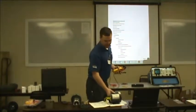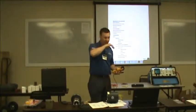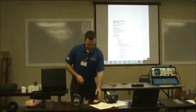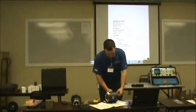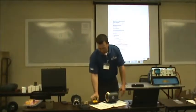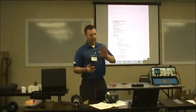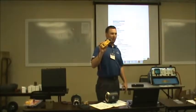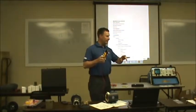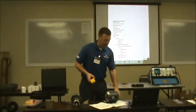We've determined, theoretically, we're gonna say we determined all the controls is okay. All controls is fine. Now we're gonna test the motor. We've got three leads coming. We're gonna turn our meter on ohms. We're gonna hook it up here, one on one, one on two. We're gonna read ohms. And as long as we're within plus or minus 5% balance on our reading between each of your three lines, A, B, and C phase, that's as far as you can go.